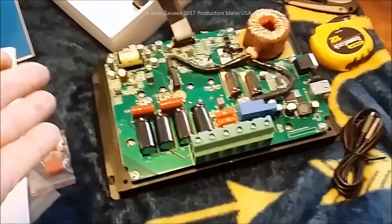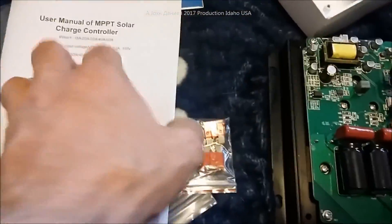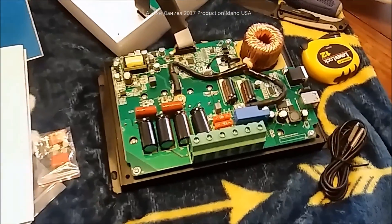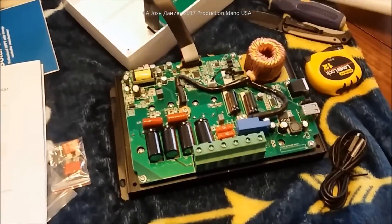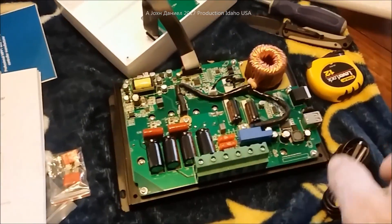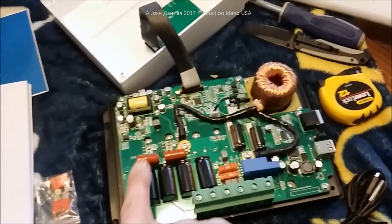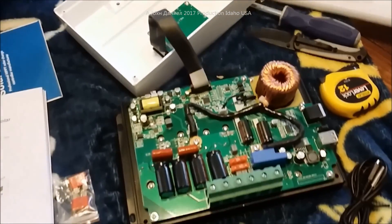It looks very well constructed with a heavily coated board. I would recommend it. Down at the link below you can find all the information from the booklet — study it if you're interested. So far they look really good. This is a real MPPT — not one of those fake ones. Be careful: they're putting 'MPPT' on everything that's either PWM, click-switch, or whatever. Only get one that's got a real toroid, true MOSFETs, and heavy capacitors — otherwise it's fake.